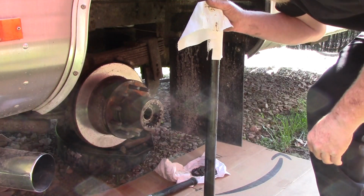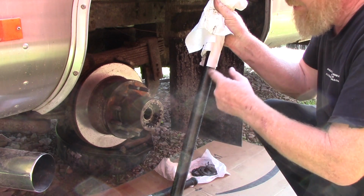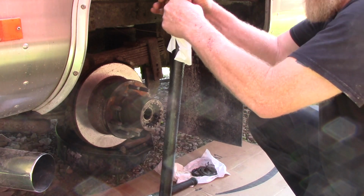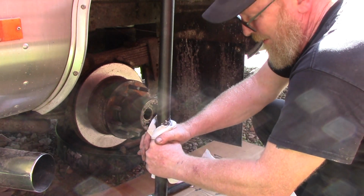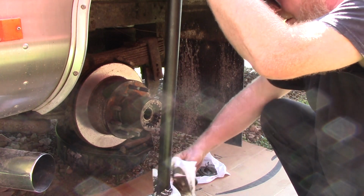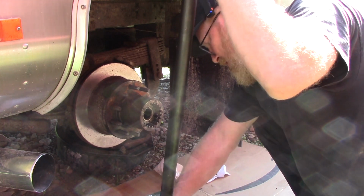Now you have an axle shaft. If you wanna look, maybe you can see the thick gooiness all over that. We wanna get that cleaned off, and there's a reason. The reason, this is what gets the oil, or rather the differential oil, out here to the bearings that we just put in. See that? Oh, what a nice, smooth, clean surface.